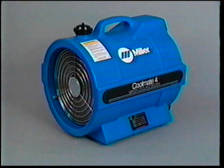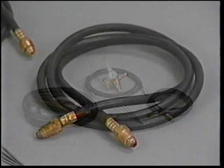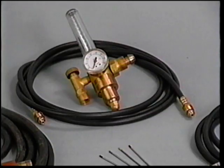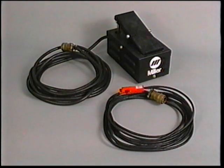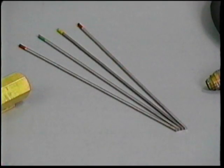If you're using a water cooled torch, you'll probably use a water recirculator — it cools the torch head and the power cable. In addition to the power source and TIG torch, you'll need hoses to connect the shielding gas, water hoses for water cooled torches, cable and clamp, regulator flow meter, remote control for the power source, a TIG block, a source of shielding gas, and a supply of consumable parts including tungsten electrodes.